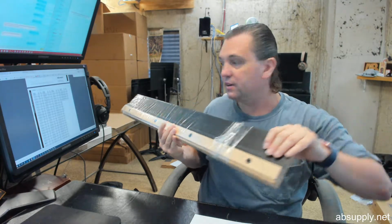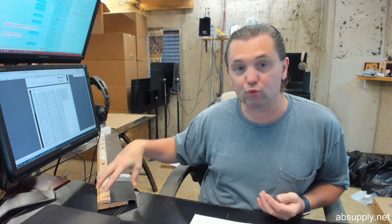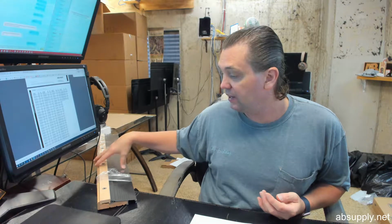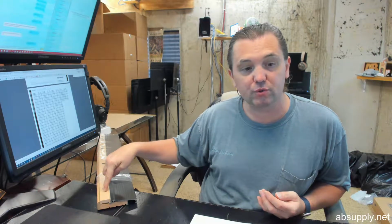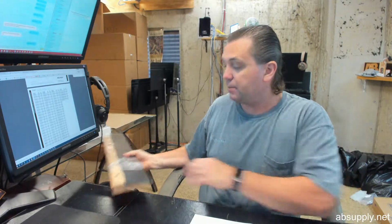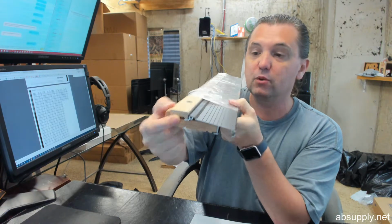The downside of what these are inherently, if you are doing a remodel, is that you're really not going to be able to extract the old threshold, and that's problematic, but that's the nature of what it is. I have had clients in the past simply delicately remove that, cut the fasteners, replace something. I've had people that have drilled right through the top of the threshold. I've had people who have told me they have removed the wood adjustable top and have screwed down right underneath it in this gap here. I've never done it myself, but I'm telling you what people have told me.